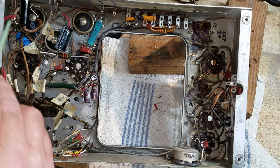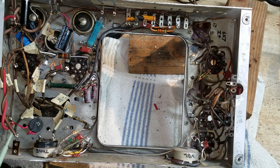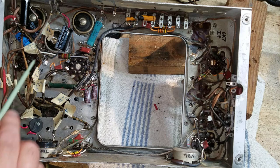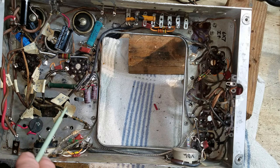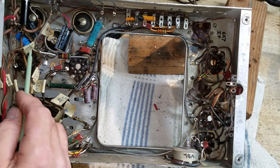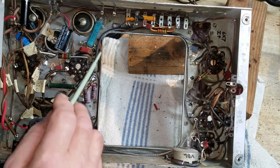The other side of the line cord just kind of wraps around the red wire, goes to this terminal strip and goes to the transformer, thus completing the primary circuit of the transformer for the radio. I've gotten all the other things installed, got all the transformer wires connected to their points. I'll remove all this tape. These tape labels, they were just to help me with the reassembly.